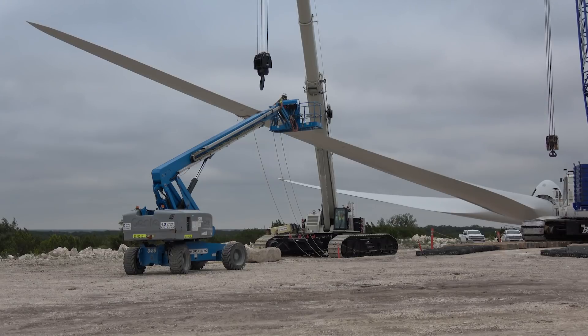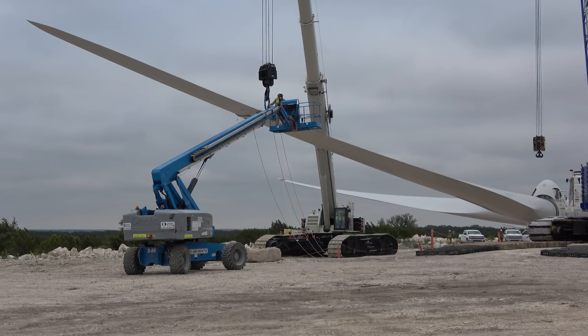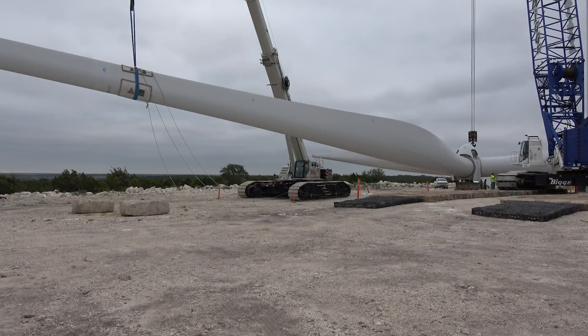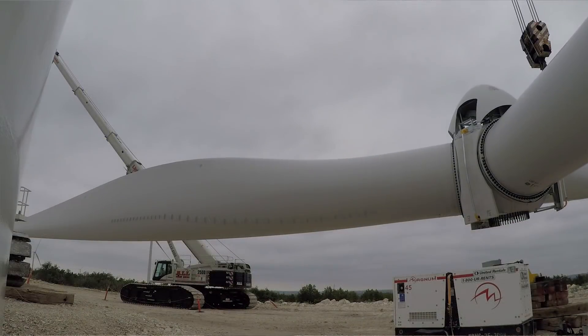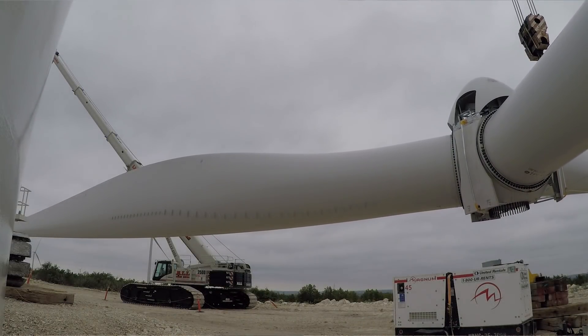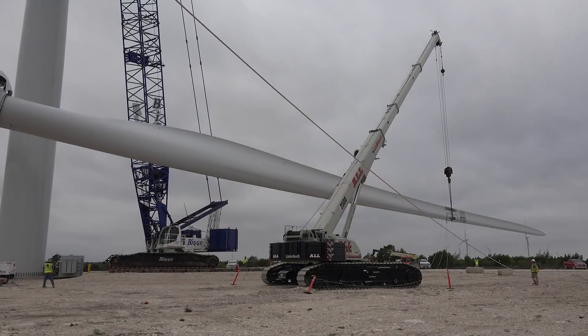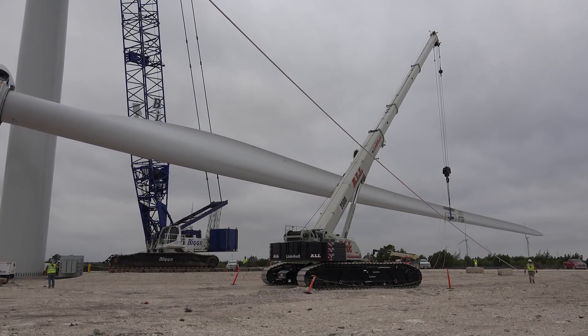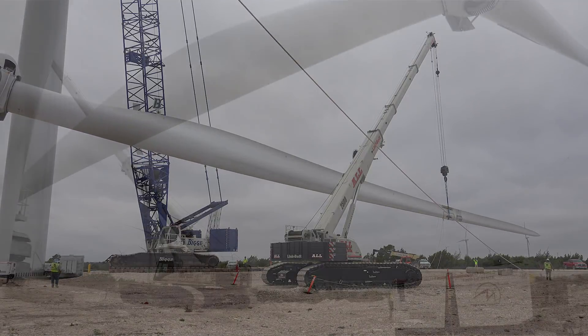When we go to trip this rotor, I'll start out — it's usually between 75 and 80 feet to where I pick it at. We'll both pick it up, and then as he goes up with it, his blade is naturally going to want to tip down. I'll just boom it down a little bit towards him, then boom it back up again and cable up to keep the blade out of the dirt. It's the simplest way to keep it off the ground so it doesn't hit anything.